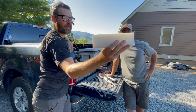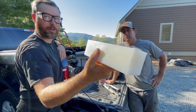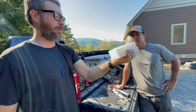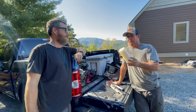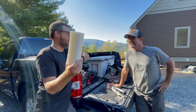This guy is like a hardened plastic beater block. And I'm telling you, this is the first day I've ever used it. It doesn't splinter like wood. It's large enough, like deep enough to just grab it and hold it without getting your fingers in the glue. It doesn't shatter into a million pieces. The glue cleans off. What's crazy is it's been in that box every time we've done floors and we never knew what it was. And John was like, why don't you try this beater block today? And we're like, wow, that thing's great. That's like a pure hunk of gold to me now.